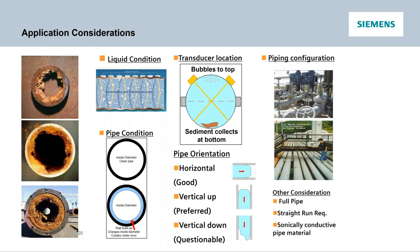Looking at pipe configuration: in some locations there is no good place to mount a flow meter, but on a straight line of pipe, that's in our favor — giving you nicely developed flow. Where we don't have that, we've got the ability to work with the transmitter to improve overall accuracy using the pipe configuration menu.